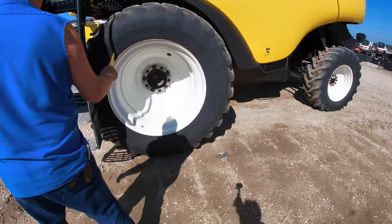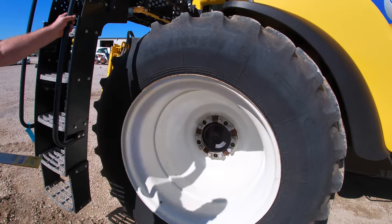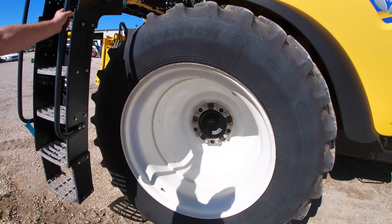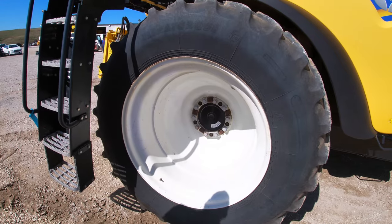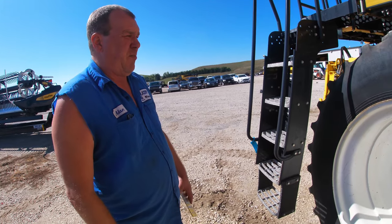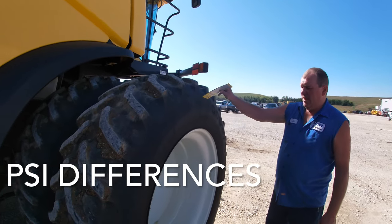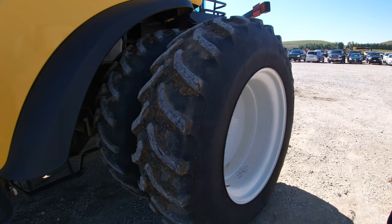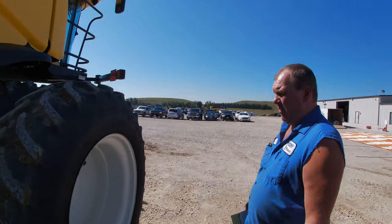Check that your wheel bolts aren't broken off. One broken bolt can sometimes run the whole season, but if you start getting three or four broke off, it's time to do something before they all break. For side tires, we try to run four to five pounds less pressure than the duals. When you're crossing ditches, you want the tires to give a little.